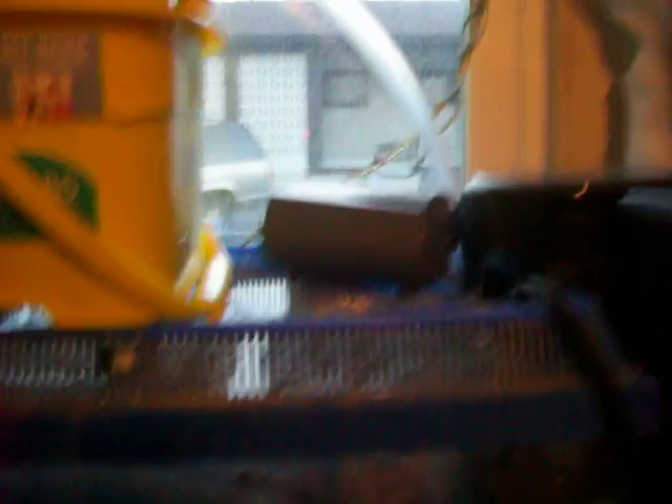I made this so it'll continue to go through for a short amount of time — a little bit longer than I'd like, but the way this siphon is set up it will just continually flood out until the timer ticks off. Instead of breaking the siphon and filling up again, it continuously floods out. It runs for about a minute 50 — and there it went, it stopped, and the siphon's broken.